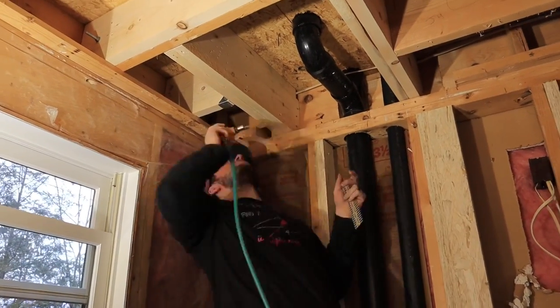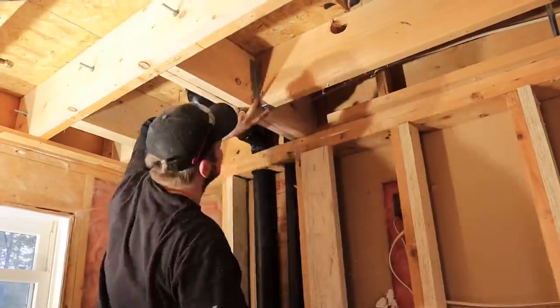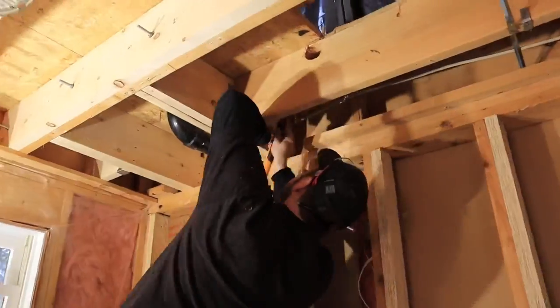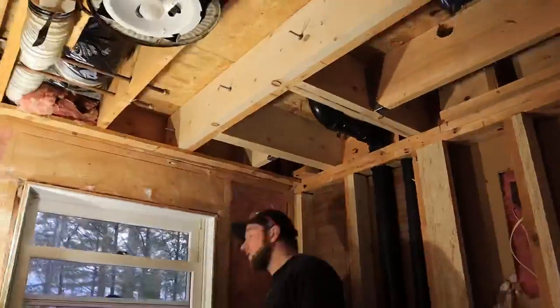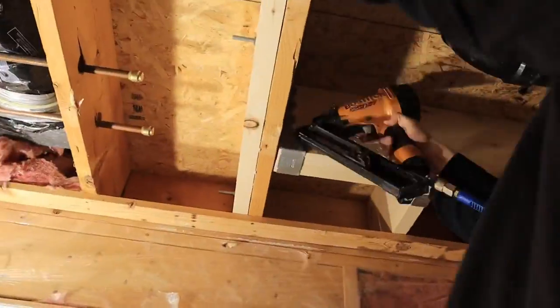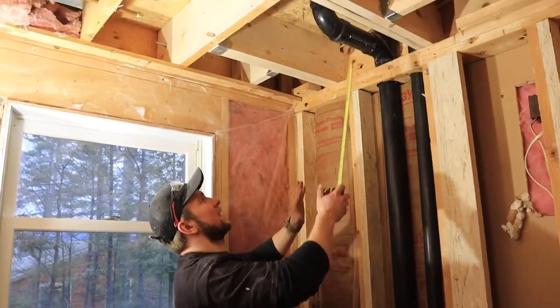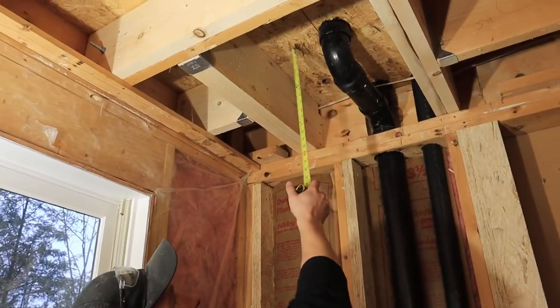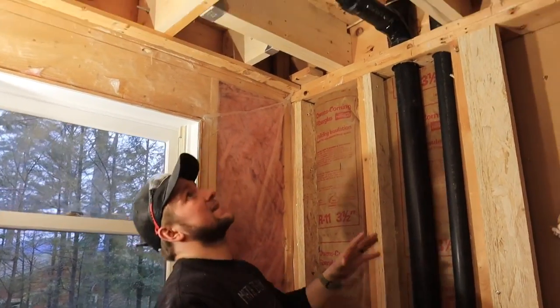I feel like this is as strong as it can get when repairing something like this. On TikTok people debated whose fault this was — I blame the plumbers. No offense, but the carpenters not putting the beam in the right spot doesn't mean you go and compromise the floor upstairs. Anyway, this gives the plumber a lot of room since the toilet flange has to get relocated. If we had tried to sister or laminate instead, it would have been a mess and might not have actually fixed it.